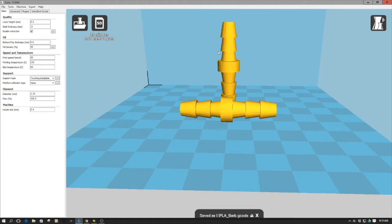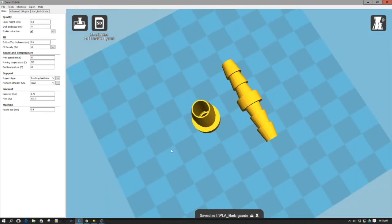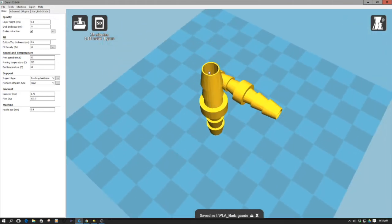I'm not sure how the barbs up top are going to print in the vertical orientation — that's what I want to see, how each one prints in comparison to the other. The insides are open, though there seems to be a slight lip. I wanted to leave the integrity of the mouth as-is because thinning it out too much makes them snap off easier. I'll save out the G-code to the card and print these with standard PLA on the Monoprice Mini Select.